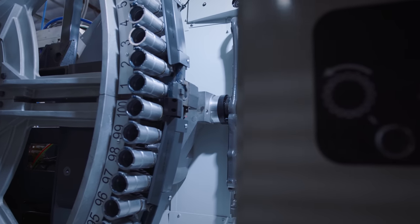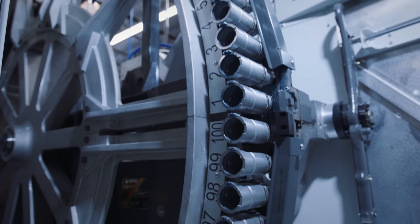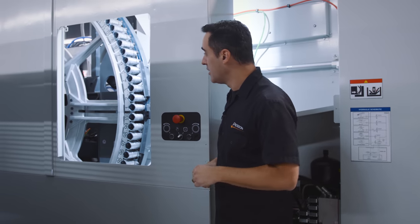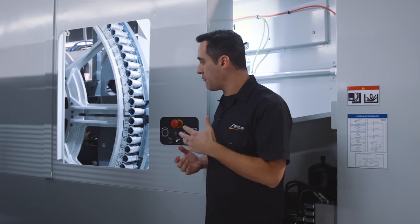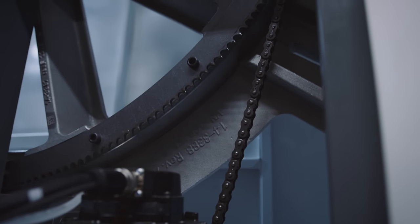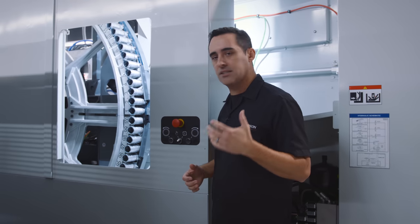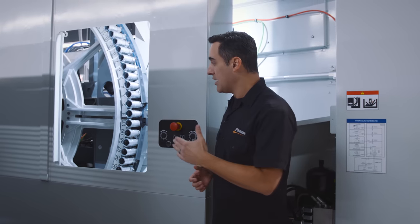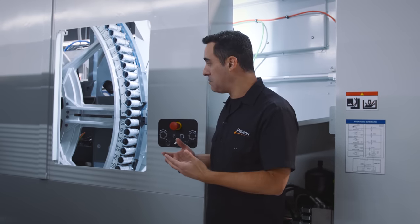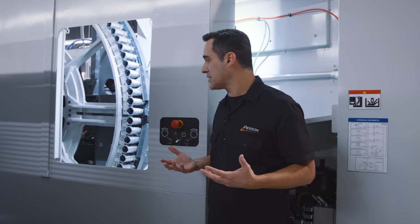This is the tool changer — a hundred position tool changer. It's like a giant Ferris wheel. I'm almost tempted — the kid in me — to hold on and do some type of stunt where I ride it, but we're not going to do that. At least not on camera. It's a pretty simplified design: a five-piece aluminum casting, five segments that make up the wheel. It's chain driven. Most tool carousels just have a servo with a worm gear, but this is chain driven and that makes sense — it's a lot of torque. If you do the math, at 12 pounds per tool max, if you maxed it out, it would be 1,200 pounds of tools hanging on that axle.